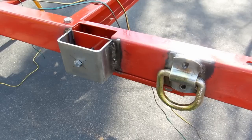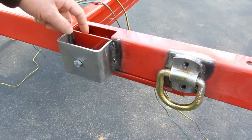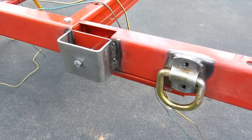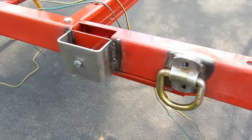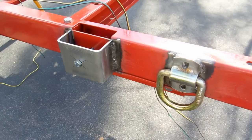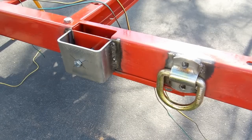Some of the key modifications I'm making to this trailer is putting my own stake pockets on the outside, because the outside dimensions of this trailer are almost exactly four feet by eight feet, and the factory puts the stake pockets on the inside. So if you use their stake pockets, you're not going to be able to put a four-by-eight sheet of plywood in with the stakes on. I want to be able to have stakes out here and have plywood or drywall in there so it doesn't accidentally slide off the trailer. I elected to weld these on. I know they make bolt-in versions with two flanges, but I wanted to learn how to weld, so I picked up a little inexpensive flux-core welder from Northern Tool for $140. This is actually my first welding project — I'm sure professional welders will have some comments about how pretty it isn't, but practice makes perfect.